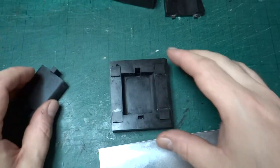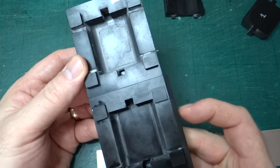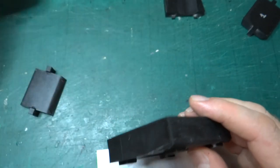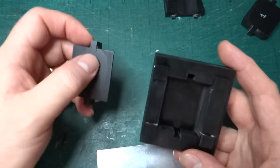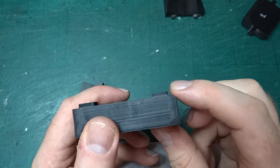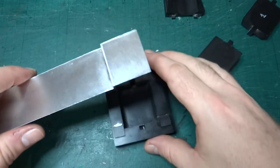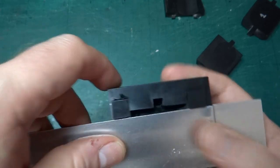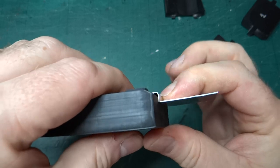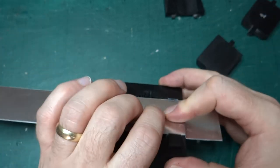The other thing I've done on this one — if we compare it with number one — is you can see it's also ever so slightly wider. There you can see the step on the edge. What I've done is added this kind of stepped corner, so I've made it longer with a slight beveled relief. The idea is — and I haven't actually tried it yet — that you put the metal across in the same way as before but this time we line the new step up against the edge. The bevel just means there's plenty of space for it to move as it folds.